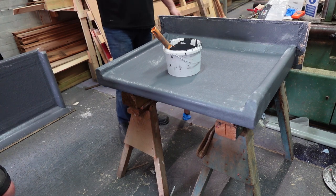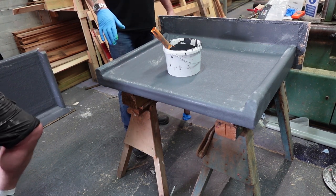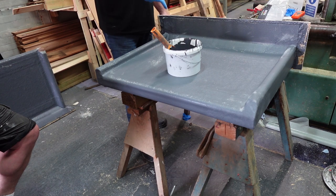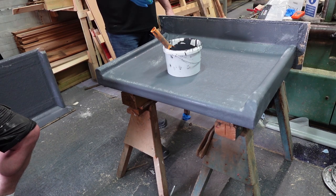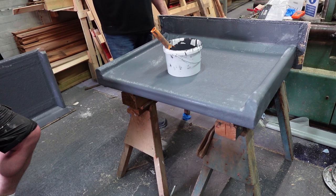Right. So right now, same day, all you need to do is sand up and wipe down. Wipe down with acetone, get the dust off it. Up to 7 days, 1 day to 7 days, acetone wipe the whole lot, because crap falls out of the sky. From 7 days to 14 days, you're going to sandpaper everything, the whole lot, and then acetone wipe, like you do with conventional. After 14 days, unfortunately, you've got to start all over again.